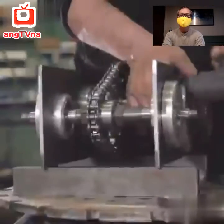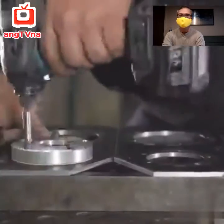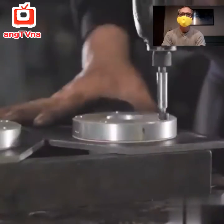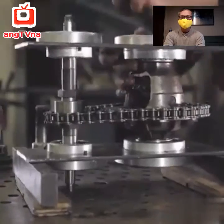The advantage to this design is that the brake is not being applied to slow the vehicle, it is simply clutching the second set of gears in or out. This means it does not dissipate energy, except in the brief period it is being applied or released.